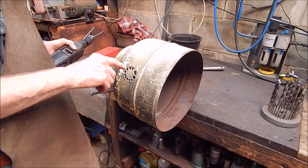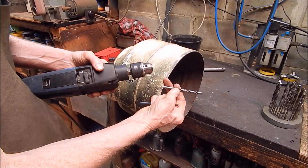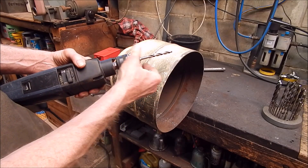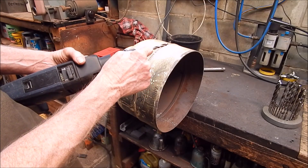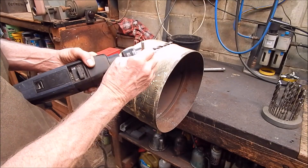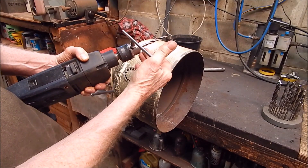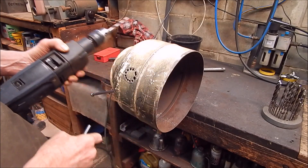We're nearly there. Here's a tip: when you put drills in chucks, don't push them right in — that's wrong. The shank is made long enough that you only use about half of it. The rest is there so the drill can flex a bit. If it tries to flex on the flutes because it's all the way in the chuck, it will snap the drill. So always only ever put them in no more than halfway — that's plenty. The depth of the jaws on the chuck gives you a good indication anyway. Pushing it right back into the body of the chuck is pointless and plain wrong.